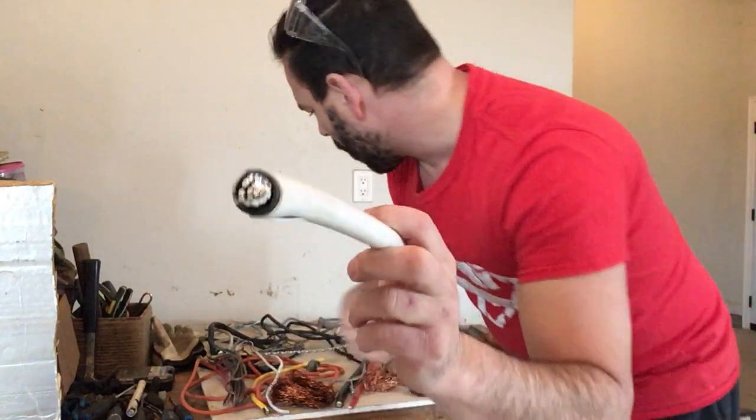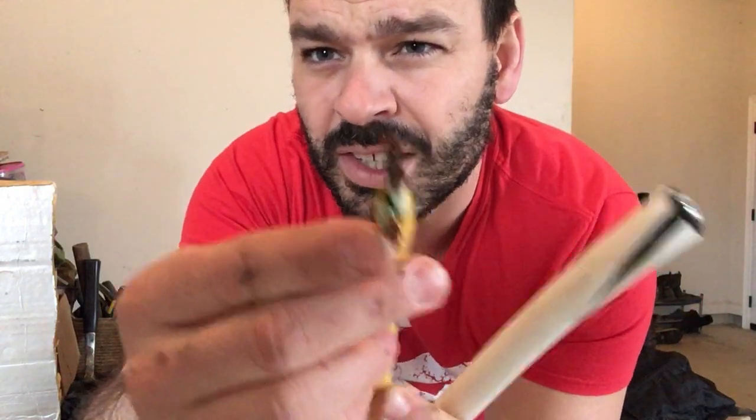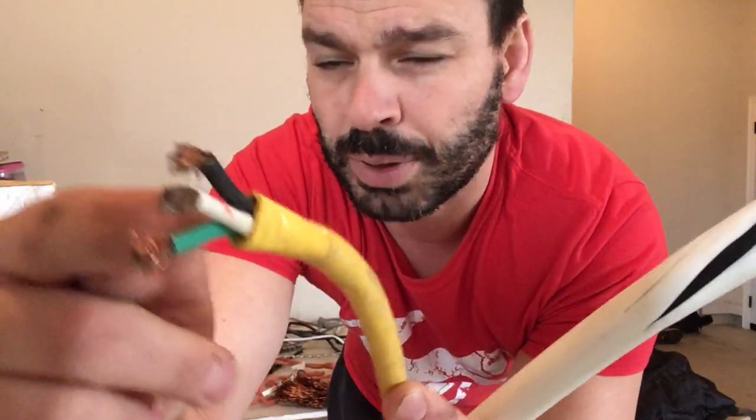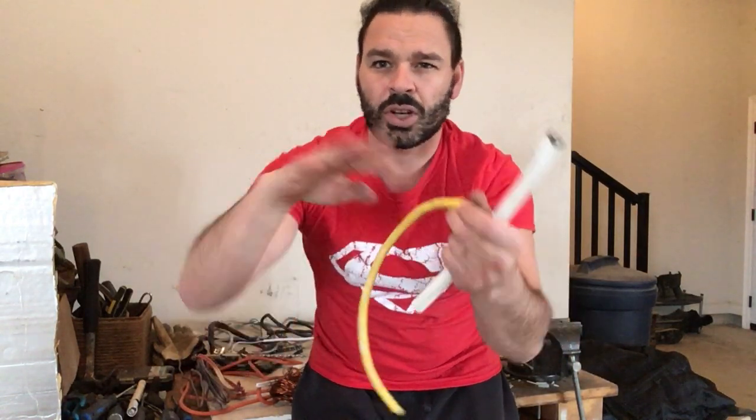But if I look at this wire, for example, or if I look at this one, it has inside 3 wires that are encased with plastic. It also has an outer wire. And what the scrapyard's going to look at is, because it has an outer coating of plastic, including the inner plastic, it's going to lower the amount of copper recovery, and it's going to increase the plastic to copper ratio.